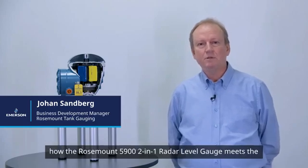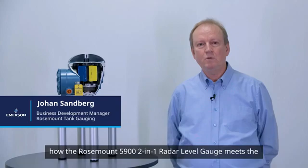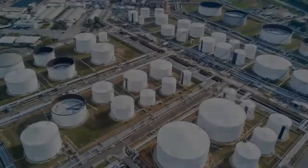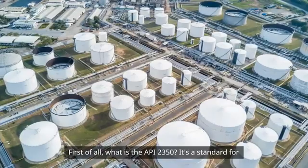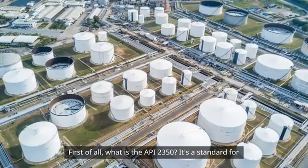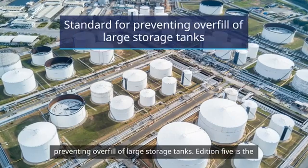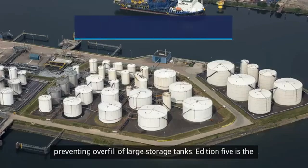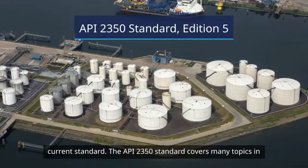This video will explain how the Rosemount 5900 2-in-1 radar level gauge meets the standard of the API 2350. First of all, what is the API 2350? It's a standard for preventing overfill of large storage tanks. Edition 5 is the current standard.